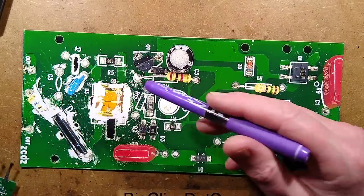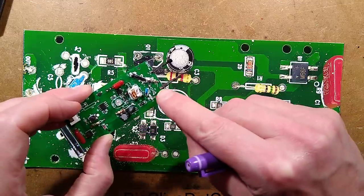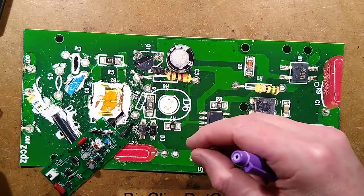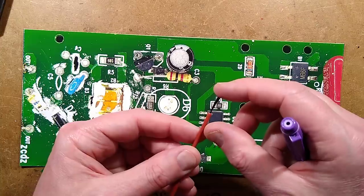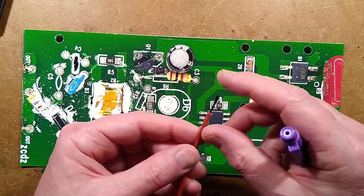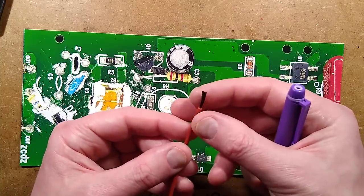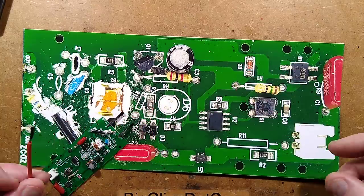And the carbon fibre emitters themselves are the little bunch of carbon fibres and a wire laid into a crimp, crimped, and then a bit of heat shrink put over it. And for those of you who want to make your own carbon fibre emitters, if you go on eBay and find rolls of the underfloor heating wire that is based in carbon fibre, when you strip it, it is a bunch of carbon fibres, like that, and it makes perfect emitters.